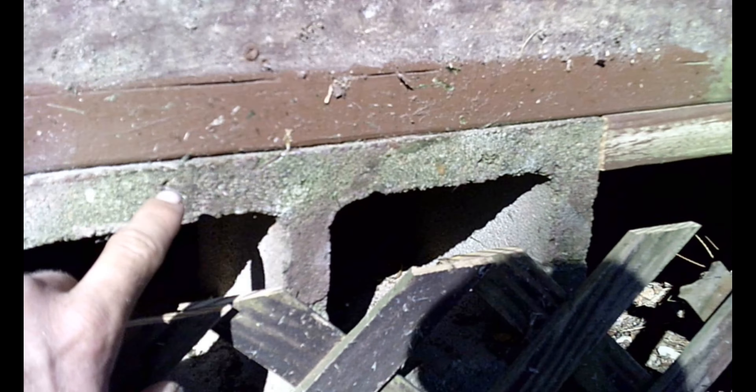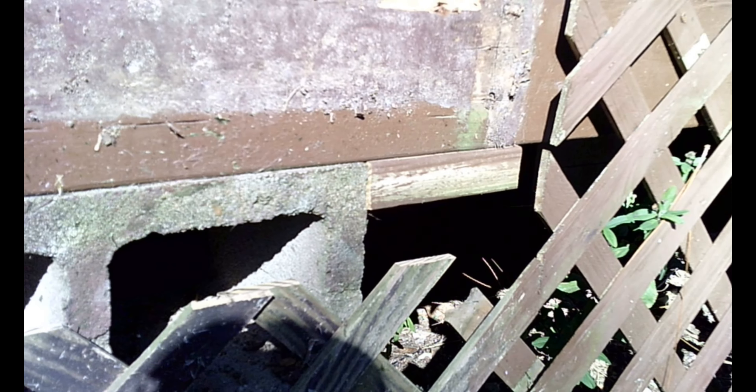We're gonna have a board down that the bottom step stringer sits on top of. I've got my first post in over here — this is gonna hold the side of a board that the top of the stringer rests against. It runs across to the other side of the steps, three and a half inches long on this side from the end of the three-foot step, and it'll attach to a rail post that comes up for a handrail. We've also cut this lattice down to accommodate for my inch-and-a-half board — I'm using two-by-six for decking — so it'll ride right over and butt up to the frame of the deck.